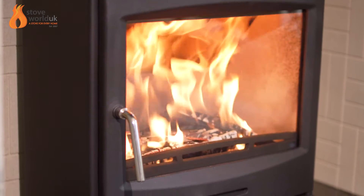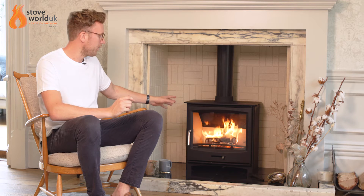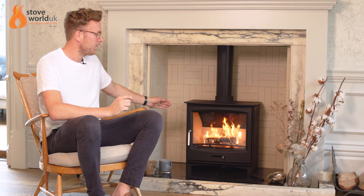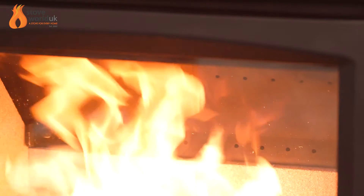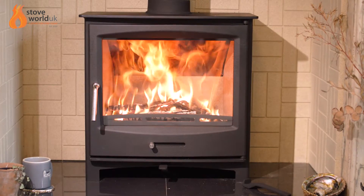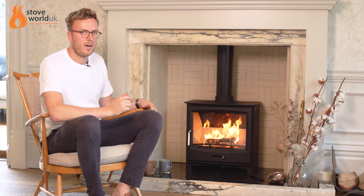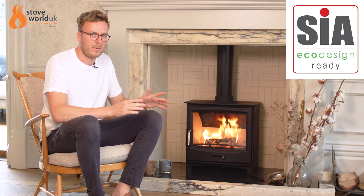The secondary airflow is flowing air through a separate chamber in the stove itself. At the back there's a separate layer of steel, and at the top as well. The air is being drawn through the rear, drawing up the back of the stove and being expelled through a series of holes on the baffle plate. You'll see the change in flames — that's where the air is rushing through and actually re-burning the initial smoke produced by the fire high up in the chamber. This makes the efficiency very high, with low CO outputs and low NOx outputs, which means this stove is suitable for the new eco design regulations coming in 2022. It actually exceeds them in all parameters, which is great.